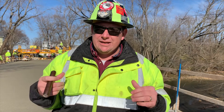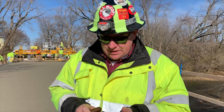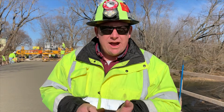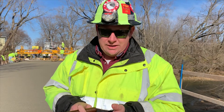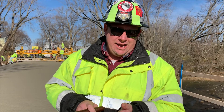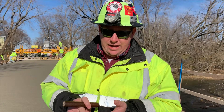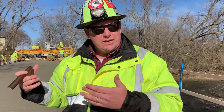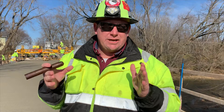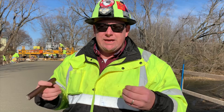With this pour behind me, it's kind of monumental, and a lot of bridge guys out there are looking at it going, what's happening here? Well, we looked at the problems we had with overlays — we would have some minor cracking. Whether the cracking was due to shrinkage or reflective cracking from the surface below, we wanted to eliminate that problem. So in this mix we've reduced cement content to aid in shrinkage, and we've added fibers to aid in shrinkage — non-corrosive fibers of course. One of the other things we said is, let's just assume that at some point it's going to crack. It's concrete, there's shrinkage — at some point it's going to crack. What are you going to do to the mix or to that surface to make it less susceptible to corrosion?